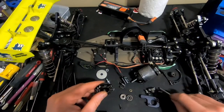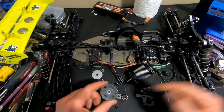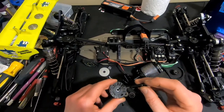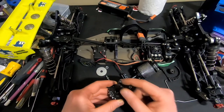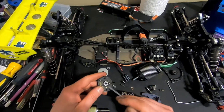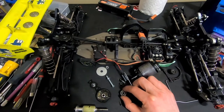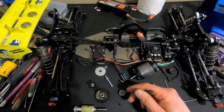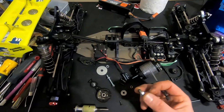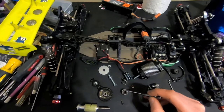Now I don't really need the cotter pin trick anymore. Same with the front bearing — it looks just the same on the outside. All I use is one of my bits, put it in there, it works out perfect, sits in there, and then just give it a whack so it pops right out. When installing the back bearing, I'd put the old bearing on top of the new bearing and hit it with a hammer — you're not going to damage the bearing underneath because it's just hitting on the face, the edges hitting each other. That's similar to pressing in a car bearing using the old bearing to press in the new one.